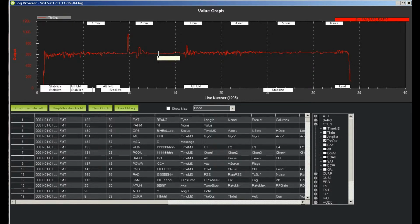What the deal is there, though, is for emergencies, you better flip that switch into stabilized mode, because if you lose a barometer or a GPS or a compass acting properly, they start acting improperly. It will make the platform go zooming off in some direction. Suddenly you're just frightened. You don't know what's going on. It's still moving at 40 miles an hour while your brain is in brain lock. Your first instinct needs to become hit stabilized mode. Stabilize your altitude, stabilize your platform, and then bring it back, land it, then come in and look at telemetry data to see what went wrong, what made it go crazy, fix that, and then fly again another day.